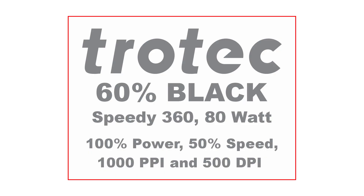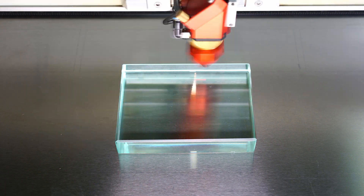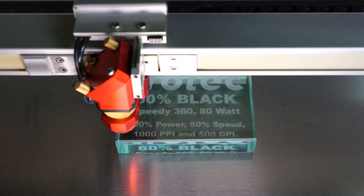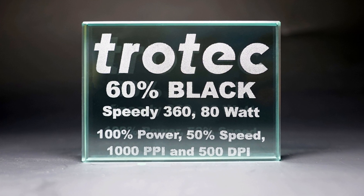To solve this common issue, the laser hack is to convert the text or graphic to a lighter shade of gray and run the laser with ordered dithering. What this does is spread out the laser pulses, reducing the amount of heat into the glass, drastically reducing the chance for the glass to chip or flake like you saw on the 100% black image.